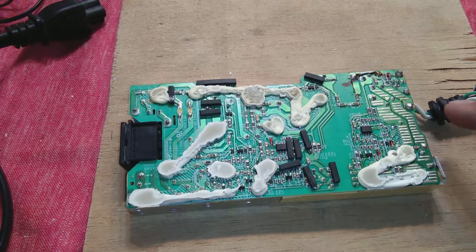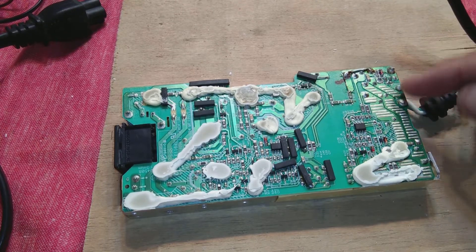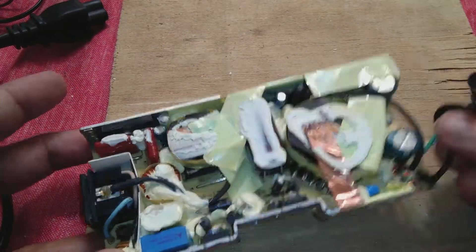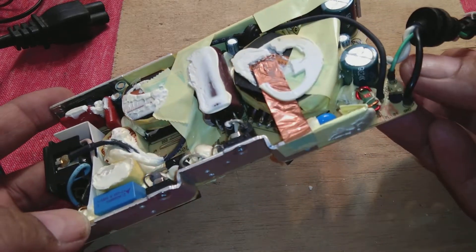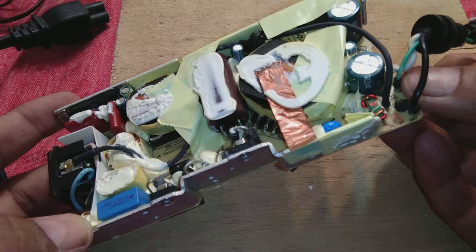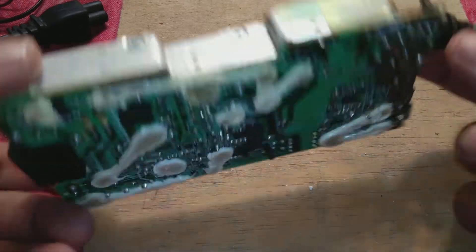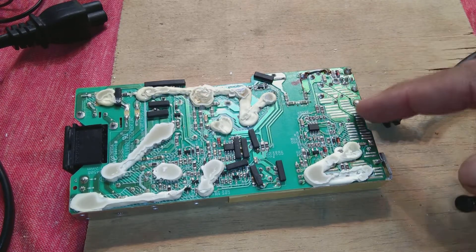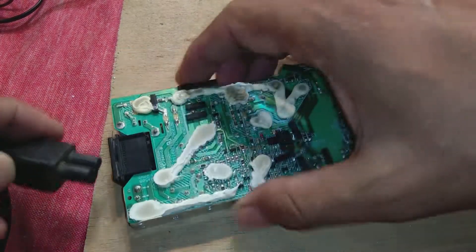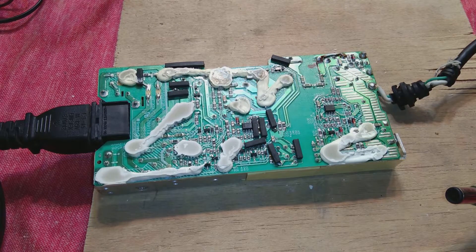We are testing inside. This cable can be broken, so we are going to verify whether the cable is good or bad. We will check voltage on these points. First is the ground, then the green wire, then this white one which is the output voltage. The green is some sort of code signal generated by the chip, and the black is negative. We will check for 19 to 19.5 volts on the white and black wires. I've powered it up now.